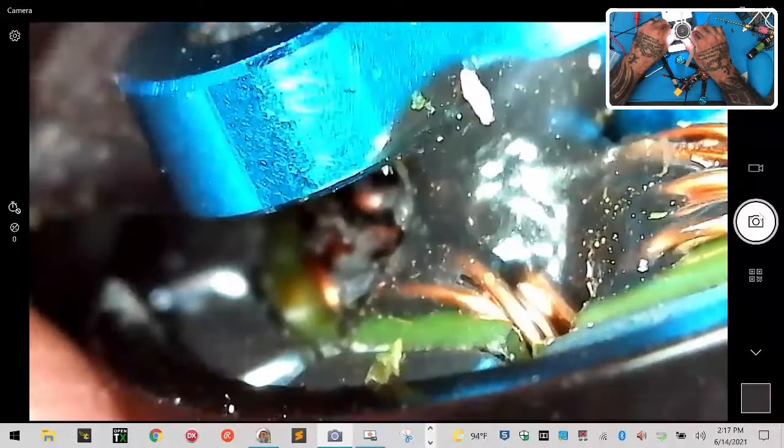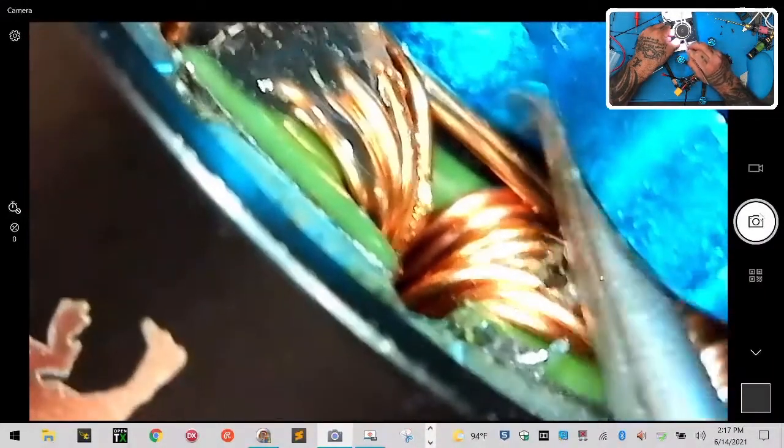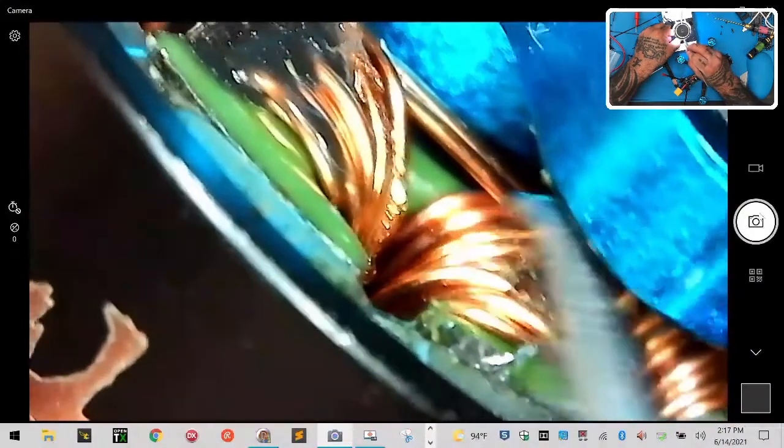Look, guys, you see that right there? You can't bullshit me out of this, guys. Come on now. All you have to do is tell me what happened. Look, you see how that's broken? That's because a screw went through and broke it. I know I'm going to catch hell from the guy who bought this. He didn't buy it from me, but everybody always gets defensive when I say, look, I know what you did. All you had to do was just tell me the truth. And they're like, no, I didn't do anything. Well, your copper's broken, and it's broken right under where the screw would go. So I'm telling you right now that you screwed this motor in. You used the wrong screws. And the reason it seems more plausible now is because you don't have the prop guards on yours.